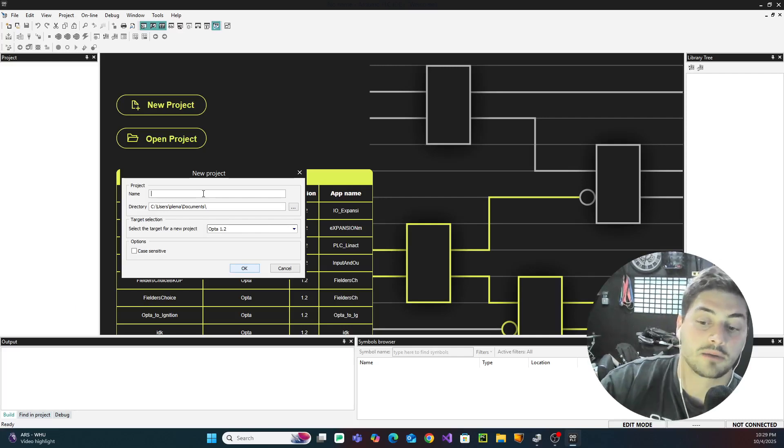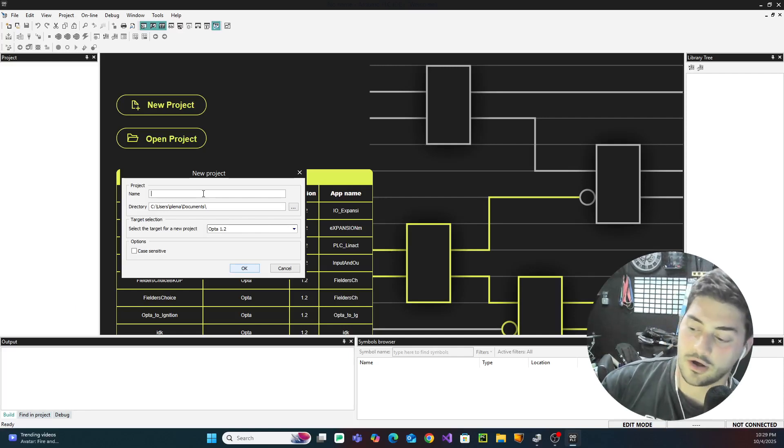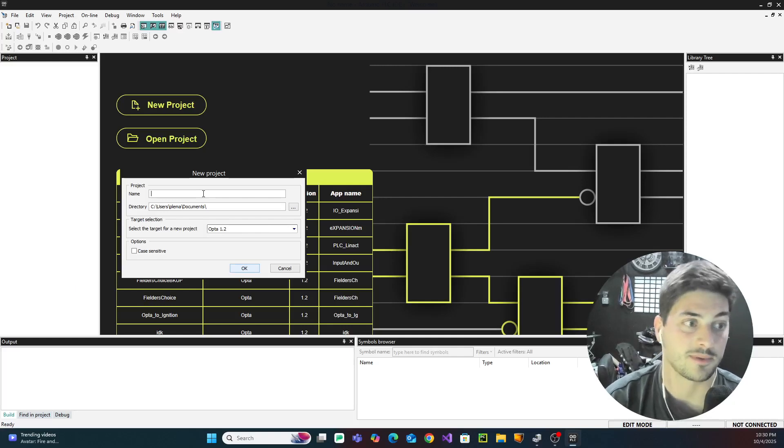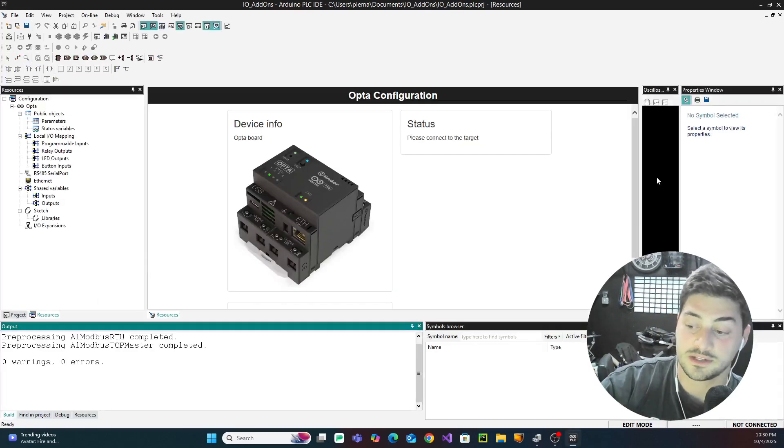You just need to look up the card that's compatible with your PLC, or you're following along with this Arduino Opta series — I'll leave all of the cards I'm using linked in the description below. To start from exactly the same spot, I'm going to make a new project for this tutorial and call it 'IO Add-Ons.' In terms of my physical setup right now, all I have is the Arduino Opta PLC plugged in via USB-C cable to my laptop and plugged into a 12-volt power supply for DC power.